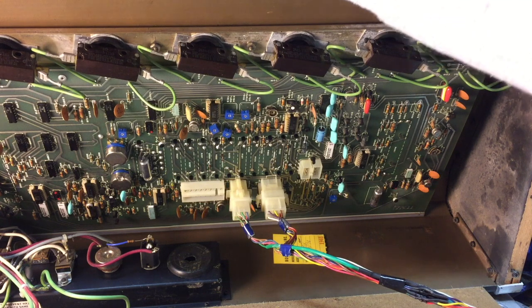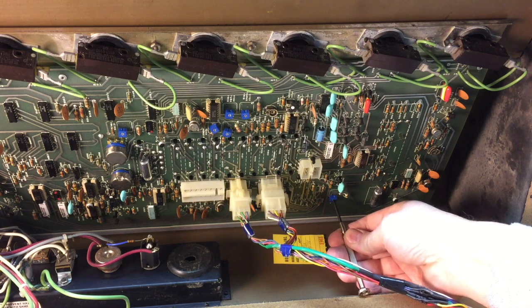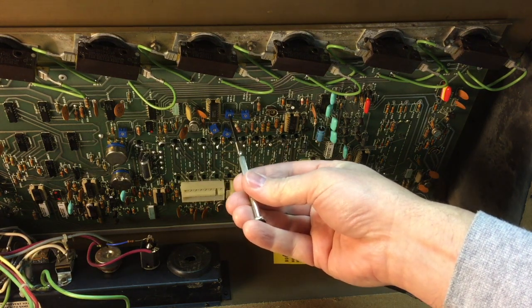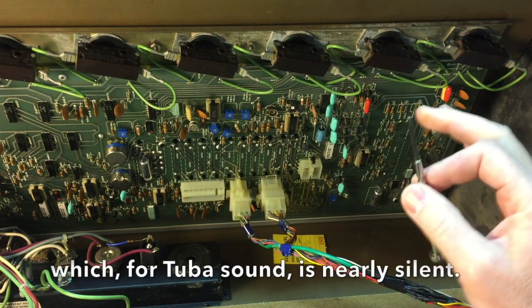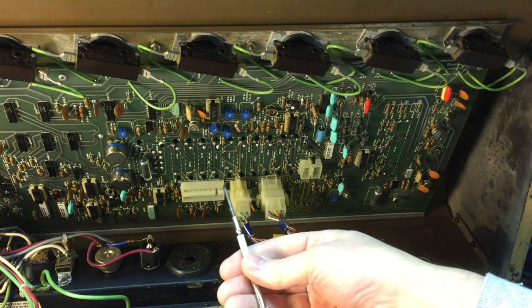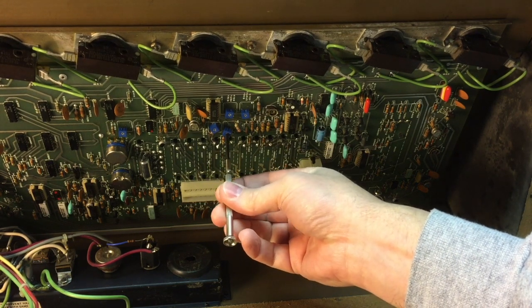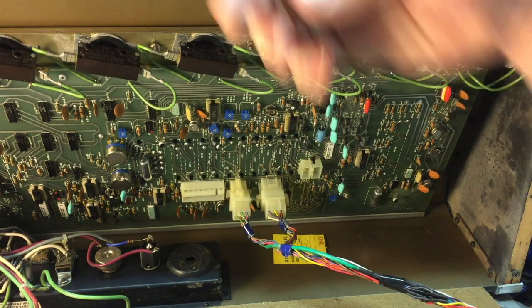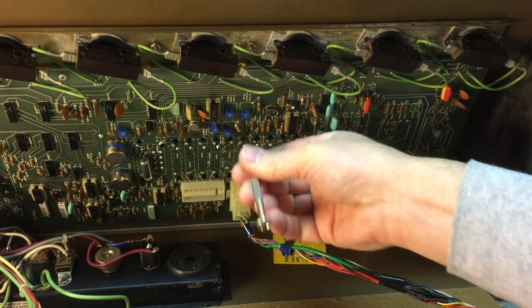I've got it opened up now and I've set it to the tuba sound. This potentiometer right here controls the pitch of oscillator A. I'm going to bring it down to about an A — it's a little bit sharper right now. There, that's about an A, and that's all well and good for the tuba frequency. Now this one here should also adjust the tuba frequency independent of the others. It's not doing anything, so I've done something wrong there and I've got to fix that. Having said that, if I go to the bass sound — that's not the Taurus frequency, that's the bass B frequency — I can't bring it down far enough. Can't even do it with frequency B. Everything is a little too high on frequency B, and the same is true for the Taurus.